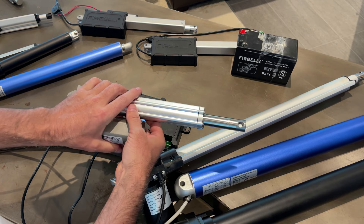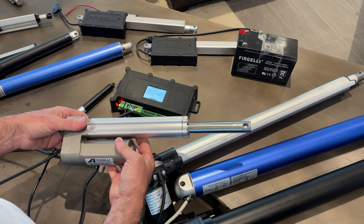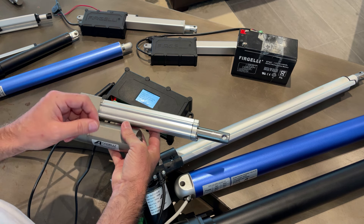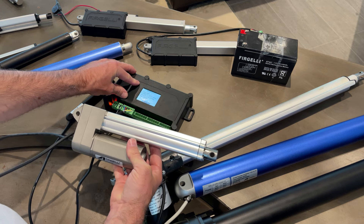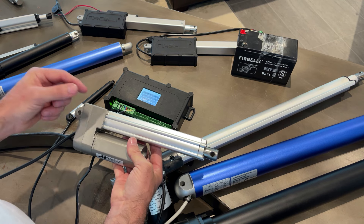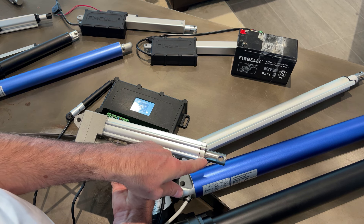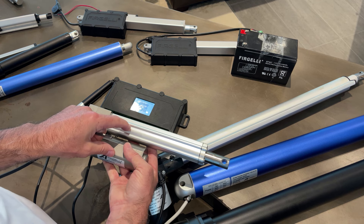What it does is run all the way to the end of the stroke and then back again. These units are slower because they're high force - 400 pounds - so remember the gear ratio trade-off. After a full calibration cycle, the computer has counted the hall sensor pulses over a full cycle. Now you have full positional control. Hit Extend and it'll extend to the position you set and stop. You cannot do that with a regular two-wire actuator.